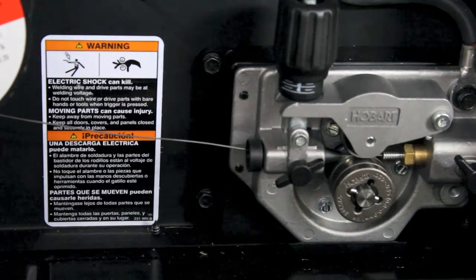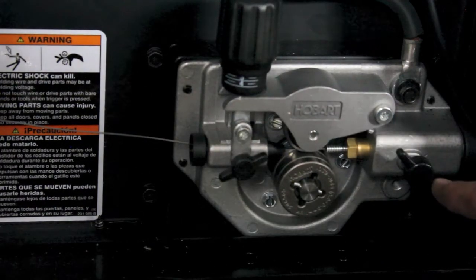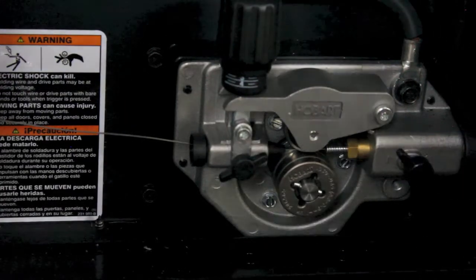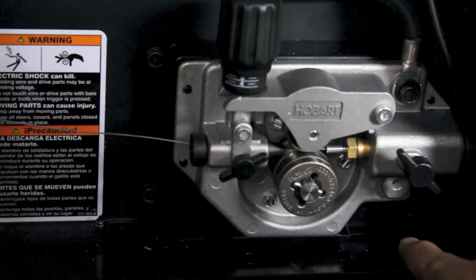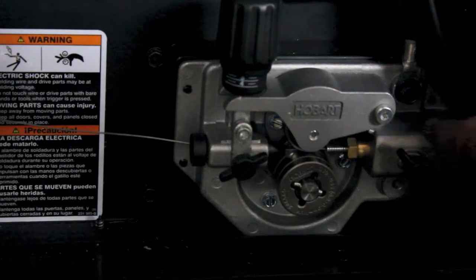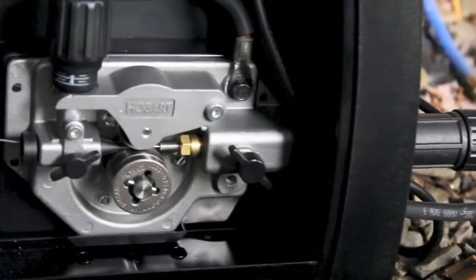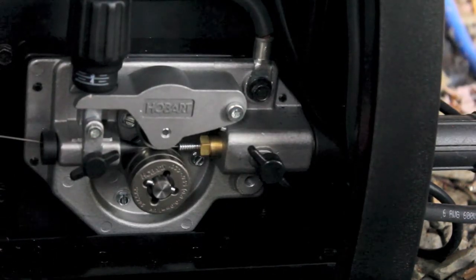So there's that. Oh, and one last thing in here, if you're taking your cord on or off, or you're installing it or whatever, you're gonna unscrew this little wing nut here, and then you'll slide this piece, if you can see that gold piece there, that actually is part of your gun, and you'll stick that into this metal cylinder here, and then you just screw that wing nut back down and it keeps your cord tight in there. You can see this section slides in there, and that's how that tightens up and stays inside of there.